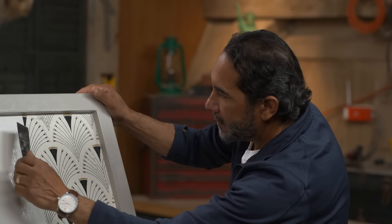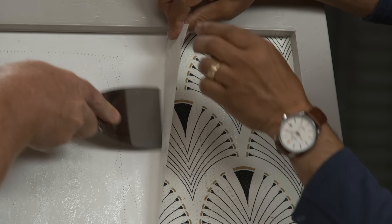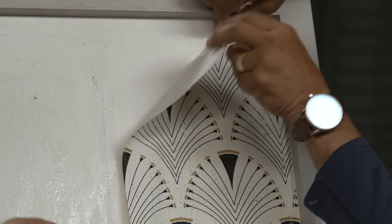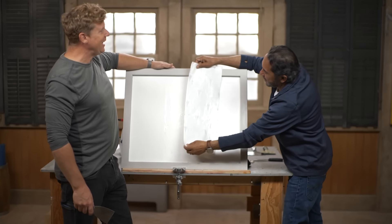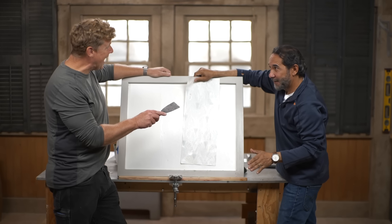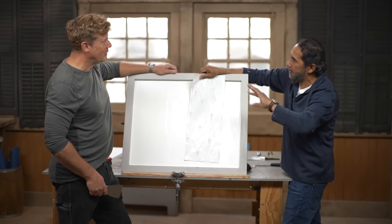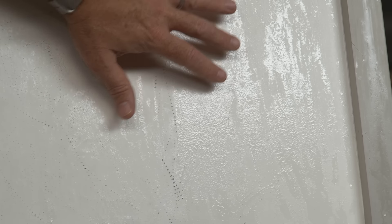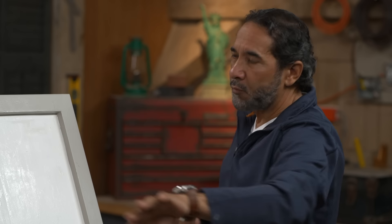So let's see how we did with the vinyl, because you're saying this is going to be harder, huh? Yeah, let's go for this one. It will work the same way as the one before. Wow, look at that! I guess that tells you that the vinegar and water is effective. It'll work really well. Holy smokes! Does it come off that easily in the field when you're going after this stuff? Not all the time. Sometimes in older homes you get old wallpaper, really thick — sometimes paper on top of paper. If that happens, what do you do? Just keep going, more scoring, more water and vinegar. Keep going until you feel like it's ready to take everything down. Now that we've got the paper off, you want to give it a little bit of spray, take a rag, clean it up — a nice clean rag, wipe it right off, and it's ready to paint.